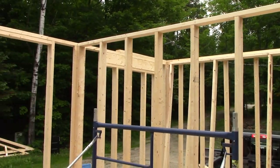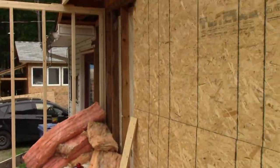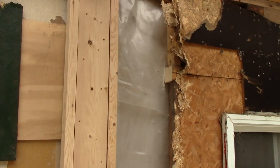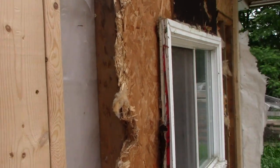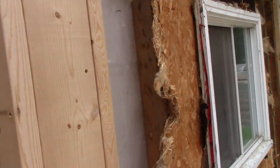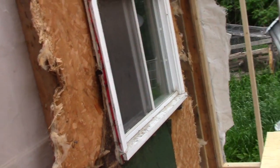I've got one wall of the pantry up and I've got the other one built — I've just got to tie into the house. I've got our 6x6 beam running the distance of the room. I've boxed this up — there's three 2x6s in there, boxed on either side and tied into the original beam that runs through the house. So it's good and solid on this side.